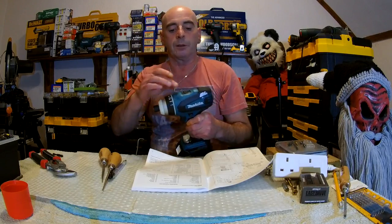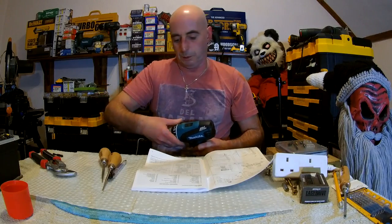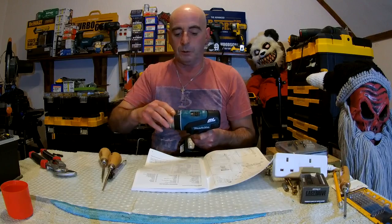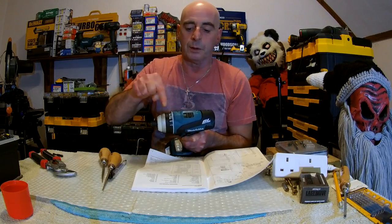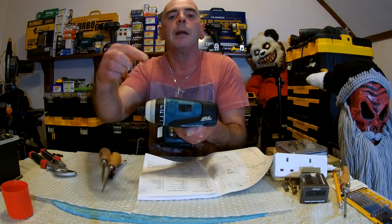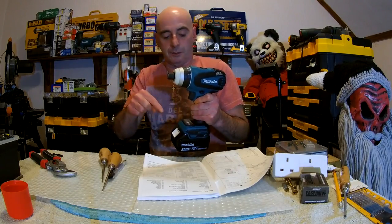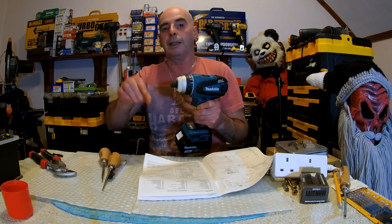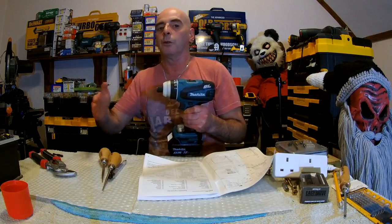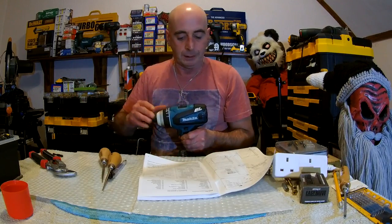Coming back through, we've done the selector, you have your main speed selector up top for high and low. Which won't work because it's in that mode. Forgot it doesn't work in impact mode. Actually, a neat trick I'll show you. When you put it over on the impact mode, right, watch what happens. It moves the speed selector up automatically. But it has another selector for that at the front. You select the actual speed there because you don't need gearing for the impacts. It actually works off the motor power for the speed. Oh, well, okay. That's that explained out of the way.